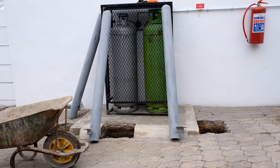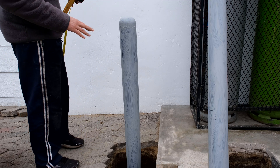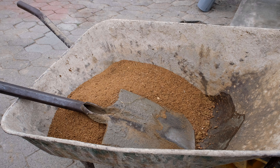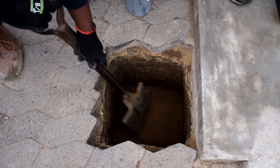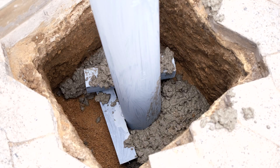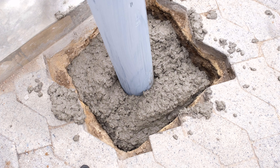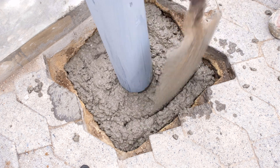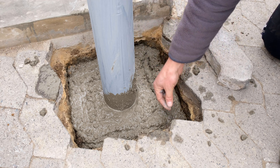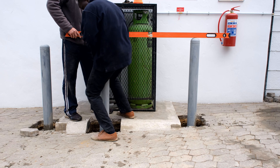The mix is ready and the poles are in place. Each pole is going to extrude one meter out from the ground, but because the driveway slopes downwards the three poles will be at slightly different heights. We'll put a little bit of sand around the pole at the bottom and drop it in to get it seated deep in that sand. To avoid them looking uneven, I'll make two the same height and the one on the far left slightly lower, lifting the middle one just slightly.